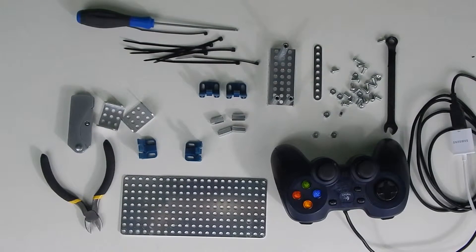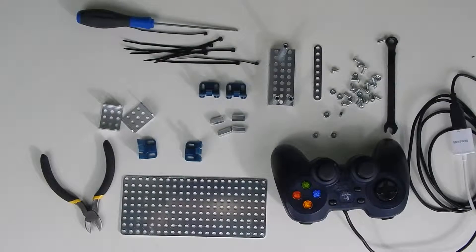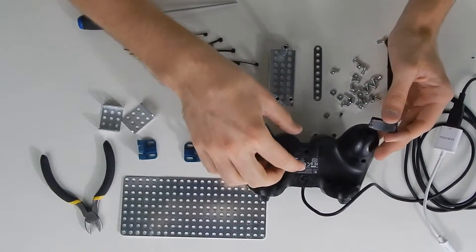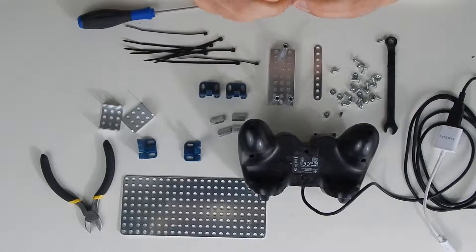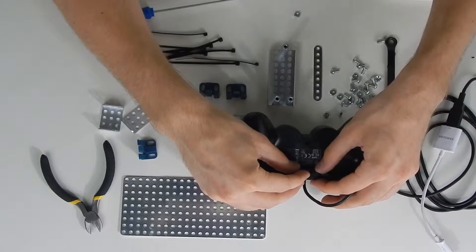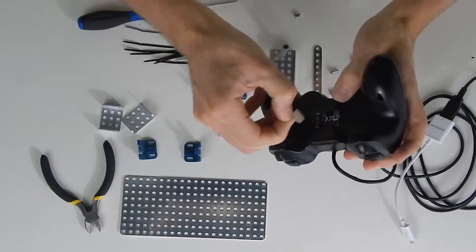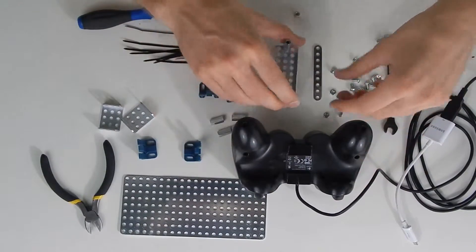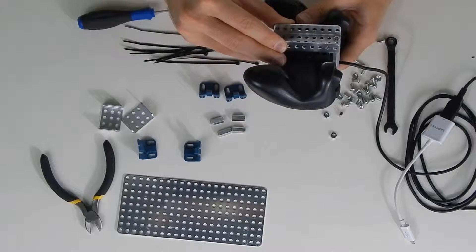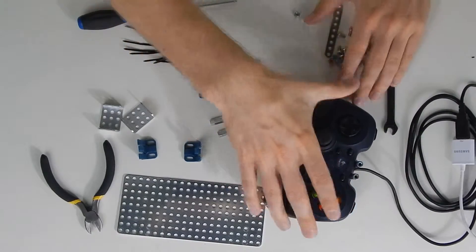Now I'm going to take some foam tape and put it on the Logitech controller. I'm going to cut the foam tape to just about 32 millimeters. On the back of the controller there's a switch that is on X or D. For the new control system you need the switch to be on X, not D. A lot of teams already have tape over their controllers — make sure you remove that tape and make sure it's on X. Then I'm taking my foam tape and putting it right over that switch. I'll put my other piece of foam tape on the bottom. Now removing the paper that protects the adhesive, I'll take these parts we assembled so far and put them square down onto that foam tape right in the middle, and push it in a little bit so it sticks. Now we have a nice platform to build from.